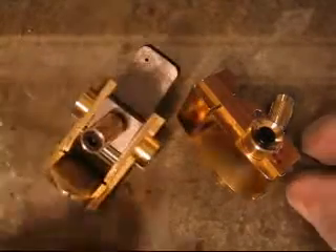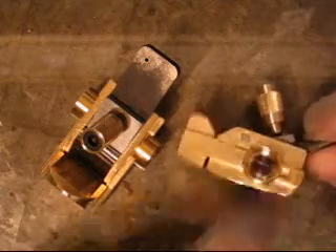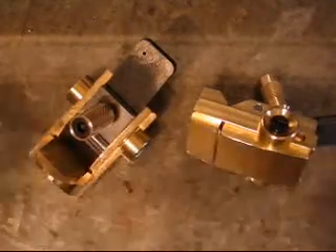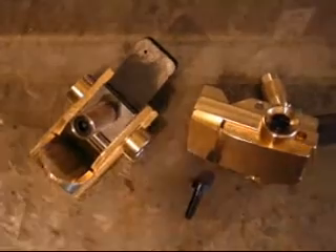A little postscript. These are the two little assembled planes. There's a radiused sole and the little blued steel screws. They're made on a one-off basis — handmade screws in the lathe. They're not hardened and tempered, but they are blued, which should be sufficient for the job.